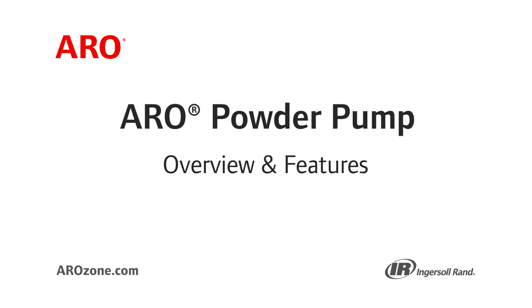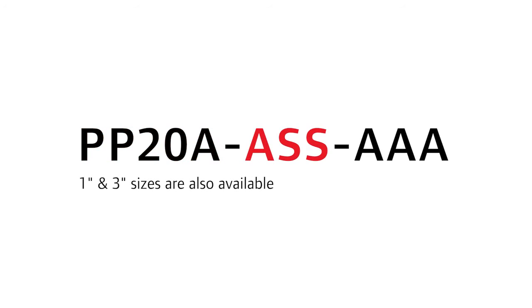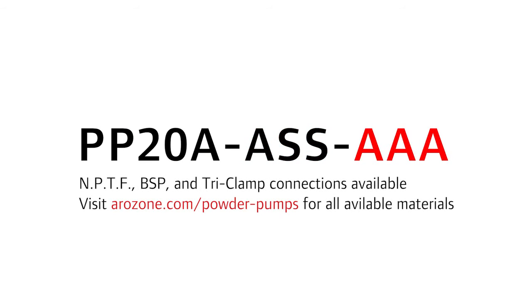Today, we will be talking about the Aro powder pump model PP20A-ASS-AAA. The PP20A indicates that this is a 2-inch powder pump. The next 3 digits indicate the connection type, wetted parts, and hardware materials, with the last 3 digits indicating the seat, ball, and diaphragm materials. In this case, we have Santoprene balls, diaphragms, and seats. There's also a medical grade option.